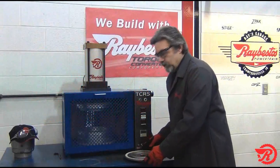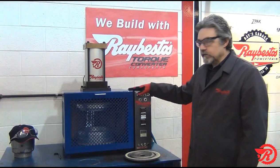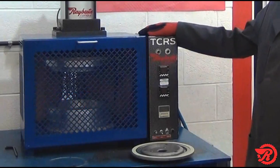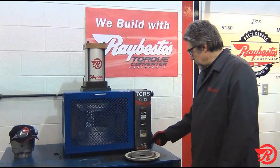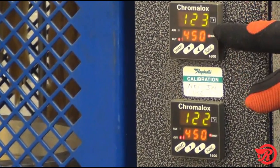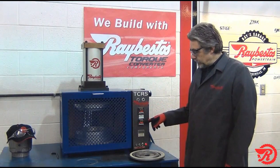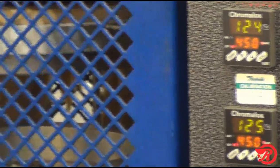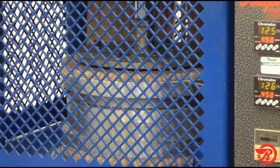Now we're going to do a time and temperature study to make sure we set our bonder up for the optimum bond. One of the first things you want to do is preheat the bonder so that it takes less time for the bonding process to occur. I'm going to turn the power on. The lower reading in red is the temperature we want the platen at — the upper platen we want at 450, the lower platen we want at 450. To speed up the heating process, I'm going to lower the ram, which will get rid of the air between the two platens and aid in the heating process.